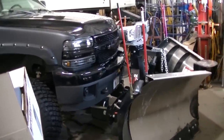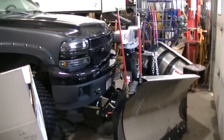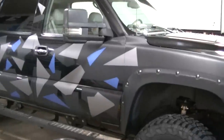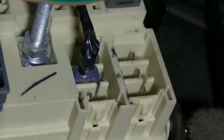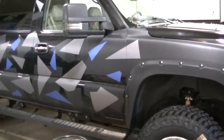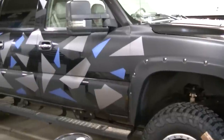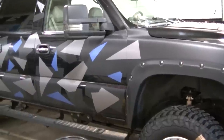I decided to go back to the shop because it was pretty nasty out. My first thought was the plug in the cab — I have my switch with a 12-volt switched power source to the remote — I thought that was coming unplugged. Got under there, looked at the fuse box, still plugged in, no issues there. Scratched my head looking over the wiring more and couldn't see any broken or unplugged wires. Checked fuses under the hood for the plow — still nothing.